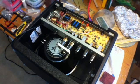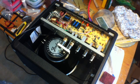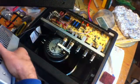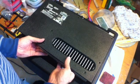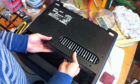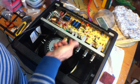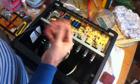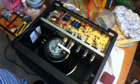Time to reassemble the amp. Alright, it's almost all back together — I've got two pieces left. Get the seven screws that hold the whole thing down back in place. These sort of accompany one another. This goes in here somehow — I think it goes like this, that makes the most sense; it sort of cradles the tubes. Here's a new innovation with the Blues Junior Series 3: these little rubber grommets. Finally, this little tube tamer is functional and won't make a tube arc from metal contact to the glass — now it's a nice rubber insulator. We are all wired up, ready to rock and roll.